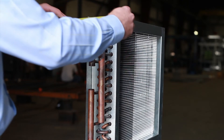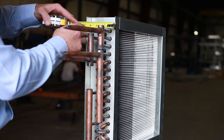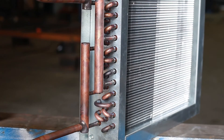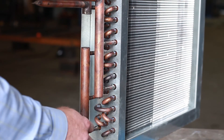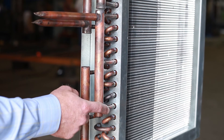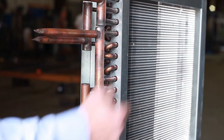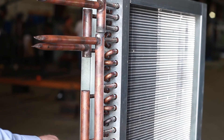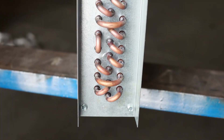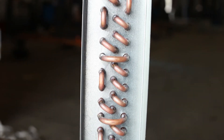We also will need the casing depth of the coil — in this case it is five inches. You also want to count the number of feeds going into the coil off the manifold; in this case there are five feeds per manifold. You want to get the number of rows deep, and if you count straight across there would be three rows of tubing in this coil.